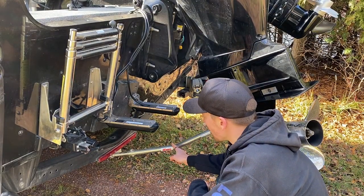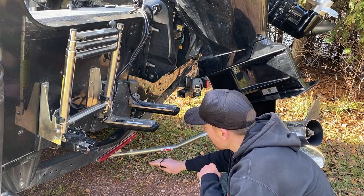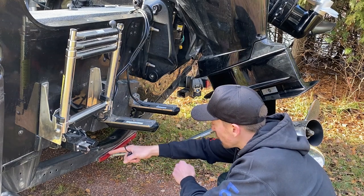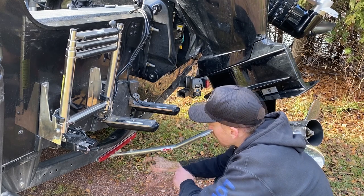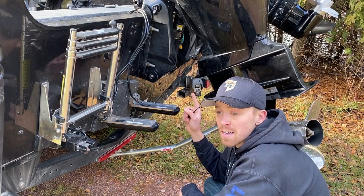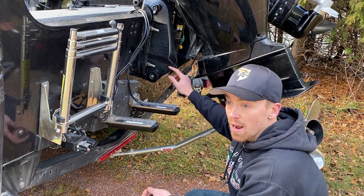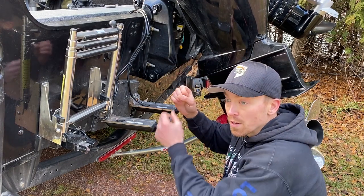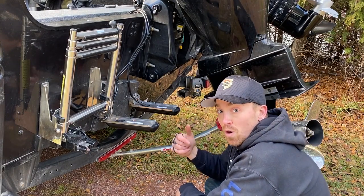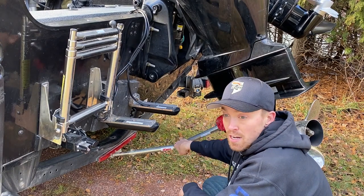The 3D Structure Scan has 455 kHz. I use this mainly for downrigging and looking for deep-water fish and structure — it overlays into a three-dimensional view underwater. As far as transom savers, this is an angled transom saver and basically the only one you can put on this boat — it's got to have that angle coming off and up. The traditional roll-on bars don't work with this Shorelander trailer. With the 150, on the newer 2016 and newer models, there are no bracket holes and no piston, so your only option is to use a transom saver with the angle.